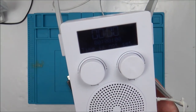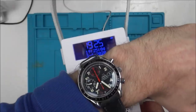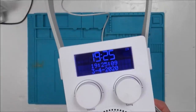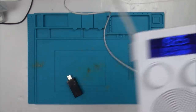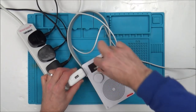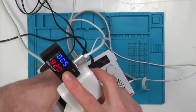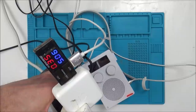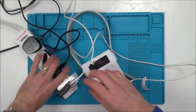But yet when I plug it in it is actually lighting up, and as well as that it's syncing up the time. Welcome to DAB digital radio — watch this, it comes up at the correct time with the correct date, and it's charging. I had this plugged in for probably about six hours earlier and yet it's still showing as charging, which is a little bit weird. But when I plug it into the meter here it is registering 0.30 amps, so it's not drawing much.